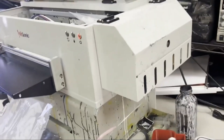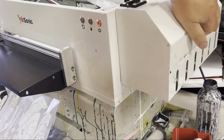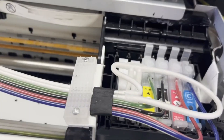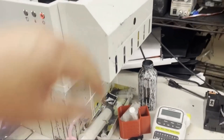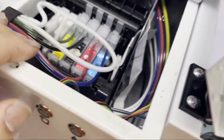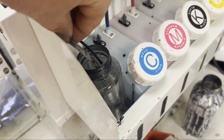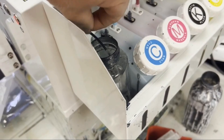I'm going to show you from the start to the middle run of this job, because I want another video focused on the shutdown and maintenance of the printer. At the beginning of the day, we want to have the white ink circulated, so we push the circulation button. Even if your tubes are filled, you want to circulate a little bit at the beginning of the day. Now let's talk about the maintenance function of this printer. This button is actually an ink pump underneath the capping station — it sucks ink from your print head and dumps it into the waste tank, using this large tube. The smaller tube is also connected to the capping station.